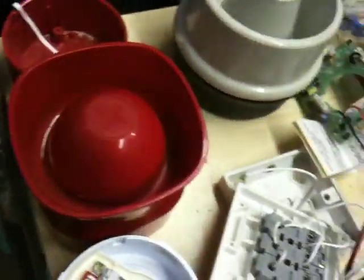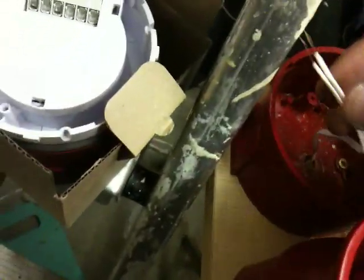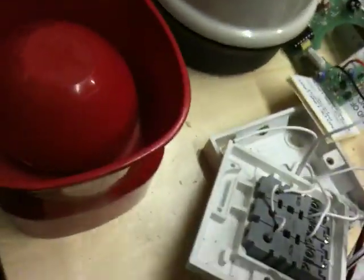That's what you need to do. Then with the bell wire you just wire it in exactly the same way. If I just get the sounder here — the bell wire — one goes there and then one would go in there. Then at the other end you would just connect up your power and it would work.